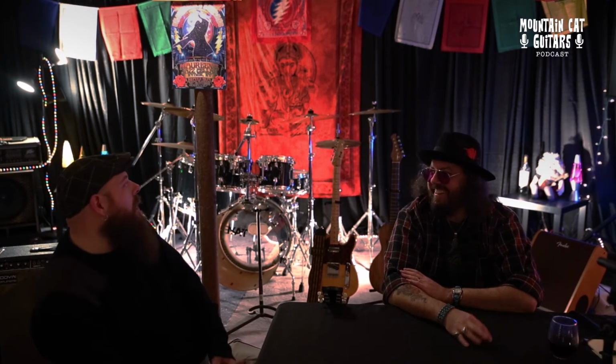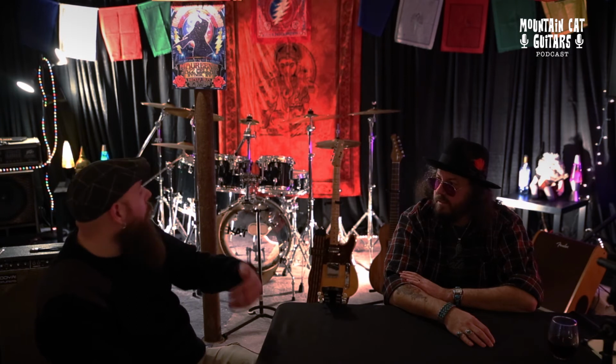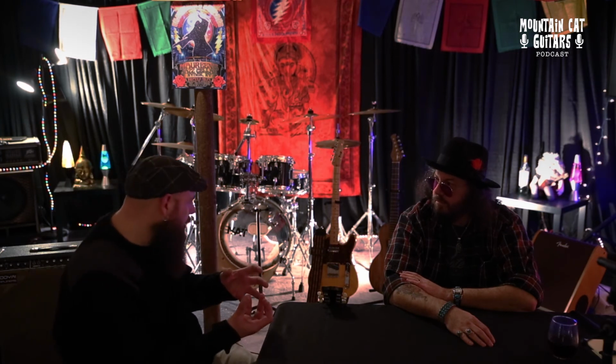There's been times where I've gotten bit. I've been doing this for a long time, man. I follow all kinds of safety procedures, discharging caps. But sometimes you get capacitors, these big electrolytics that we call can caps. You'll see them hanging from underneath amplifiers. They look like big soda cans, and they're usually multi-section electrolytic capacitors, which means there are 3 or 4 capacitors inside. They're all grounded via a little spot weld on the inside of the can. So when the can mounts to the chassis, the capacitor is grounded.